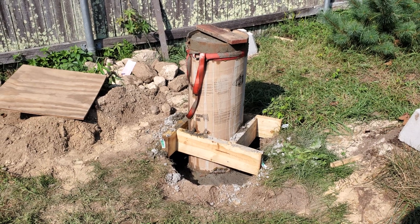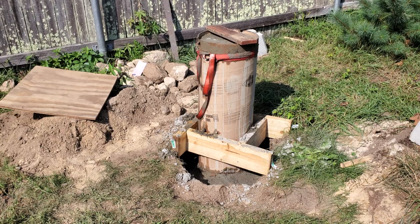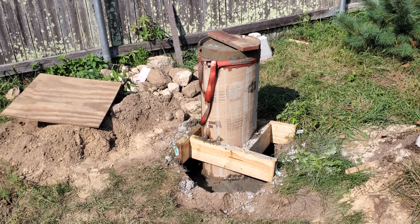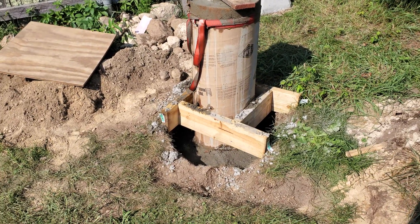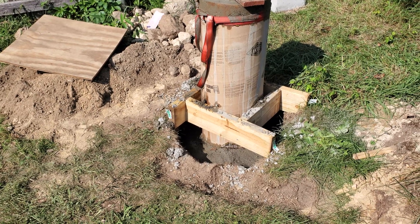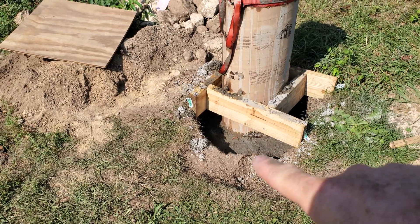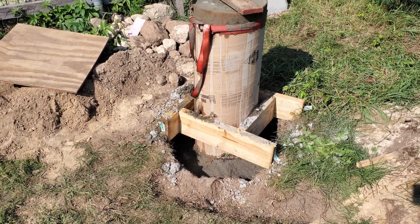Today we just finished pouring 900 pounds of concrete. I have a 12-inch sonotube inside a hole — the sonotube went down three feet, but the hole is actually four feet deep. The cement in the hole is only about eight inches below grade.